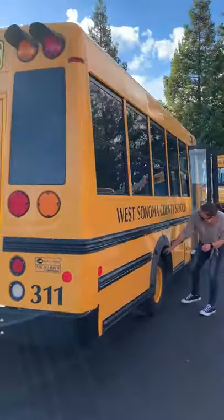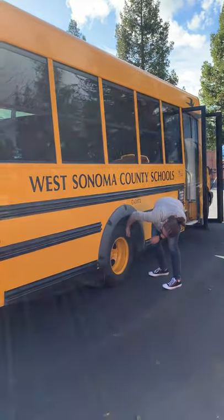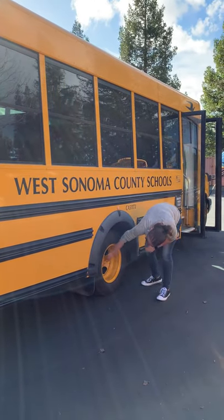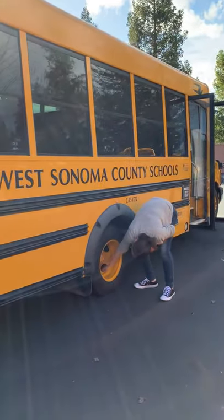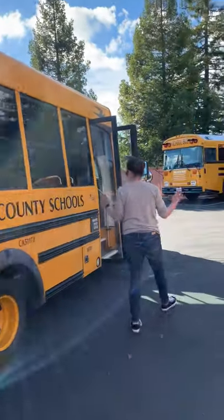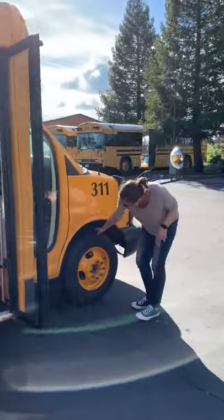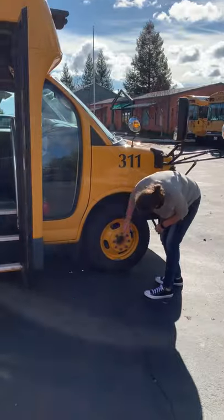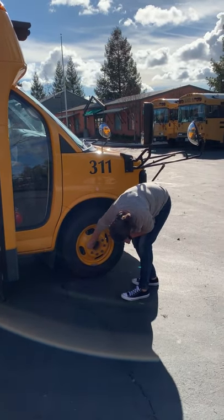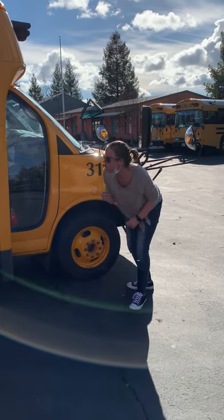checking my next set of tires, minimum tread depth, 2/32 inch, checking for ABCs on the wall of the tire, cracks, dings, dents on the rim, lug nuts, grease seal, valve stem and cap. Looking, no major damage. My last tire, minimum tread depth, 4/32 inch. Checking the wall of the tire for the ABCs, cracks, dings, dents in the rim, lug nuts are tight, grease seals clear, and valve stem and cap.